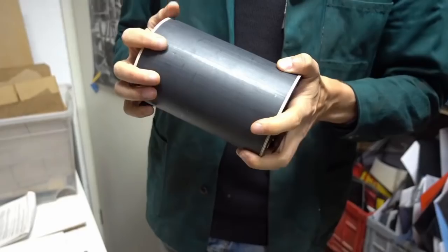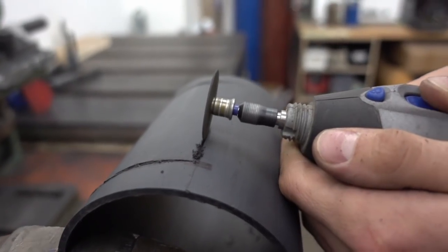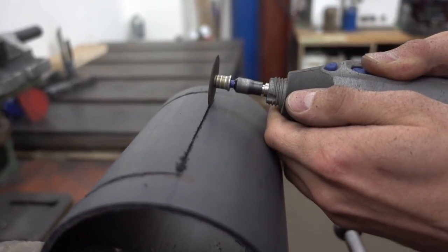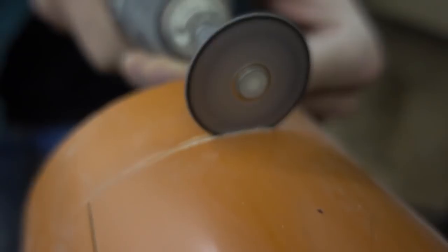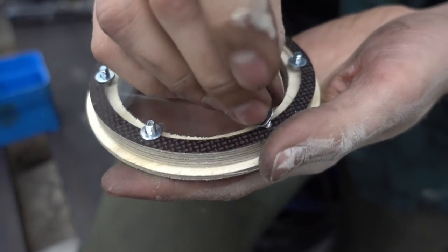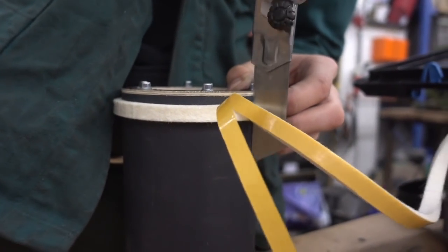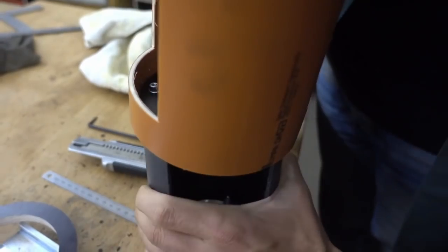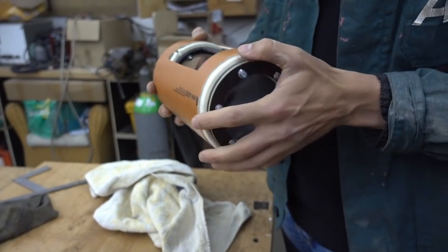Those parts are fitted into the tube and everything works fine since it was all designed in 3D models beforehand. You can then cut the openings into the tubes — the outer one requires two openings, one at the top and one at the bottom, and the inner one only one. Make sure that the openings are big enough for the plastic you want to recycle, like yogurt cups. To fix the plexiglass to the wooden part, use screws and nuts — the washers help hold the circle. To keep a certain distance between the inner and outer tube, we tried a felt ribbon but that didn't work well due to too much friction. A much better solution is to use a plexiglass ring instead.